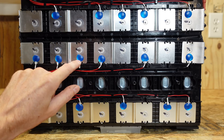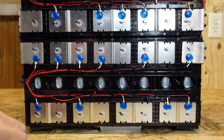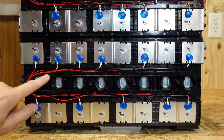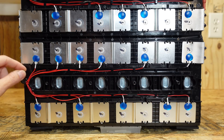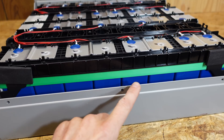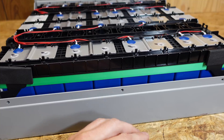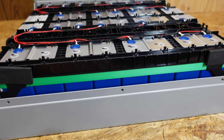The balance leads are protected with a hard rubberized blue material — I'm not sure if that's sealant or some type of glue to hold it in place. Those leads are nicely routed down the center with various points holding them in place and they are nicely bundled. From the back of the battery we can get a glimpse at the individual cells themselves — they all appear to be nicely lined up and perfectly straight. I don't see any bloating or space between them to indicate a problem.